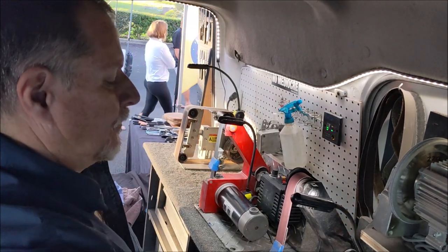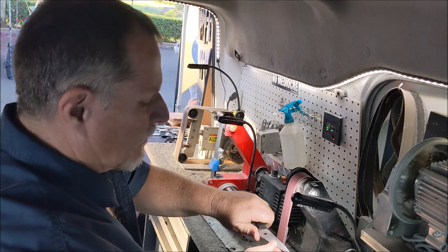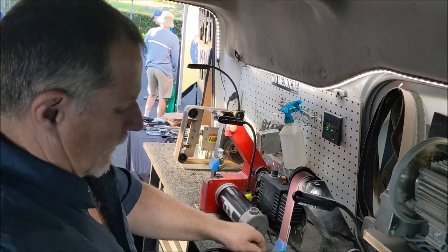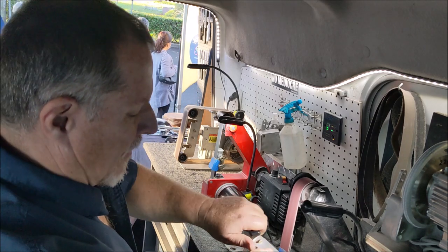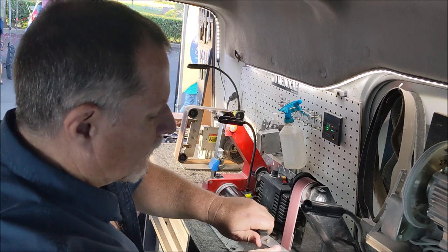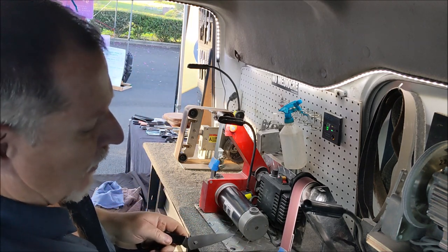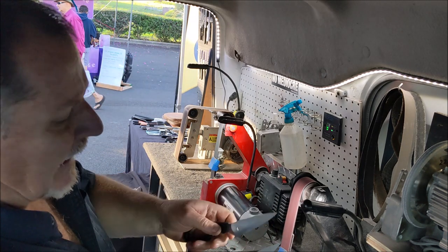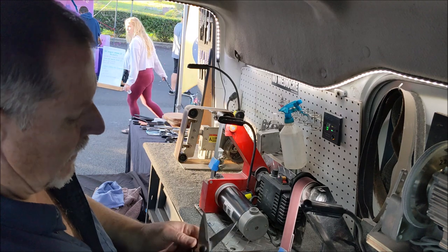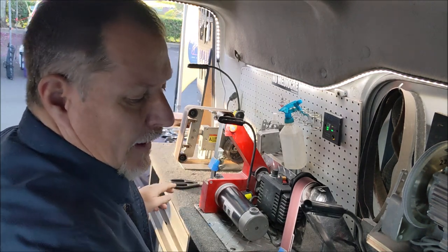Scissors like this are usually about 15 degrees, maybe less. You don't need to clamp them and do all that. Pull up a clean burr. There are no little dings or nicks. Oh wow, there we go. And you can gently cut it off, massage it off. All right, let's get some sharpening done.